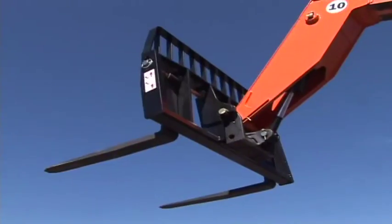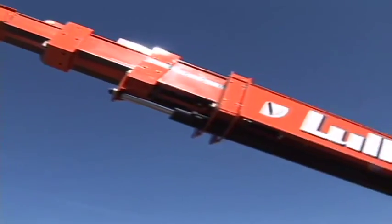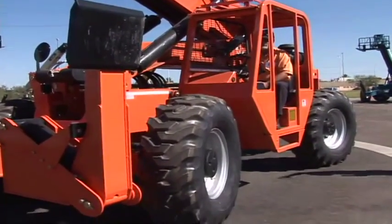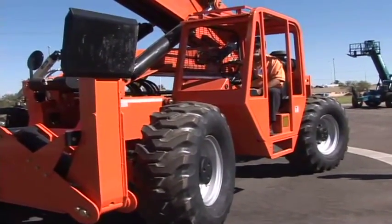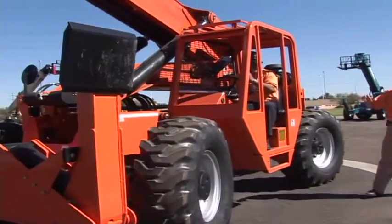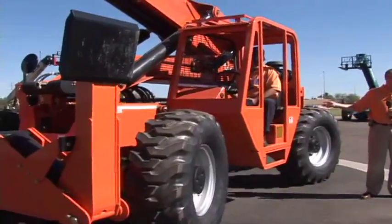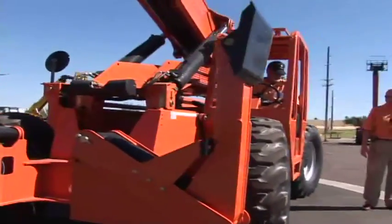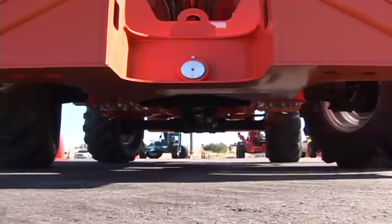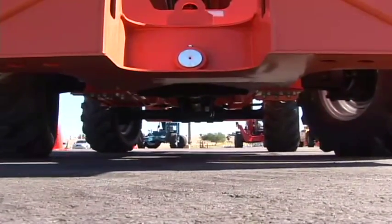The engine is a John Deere 115 horsepower turbo, running at 2,500 RPM. It has spin-on fuel and oil filters. The air filtration is two-stage with a pop-up indicator. The engine can be easily serviced from the top, and the traversing carriage slides forward so all the service aspects are easily accessible from the sides of the machine.